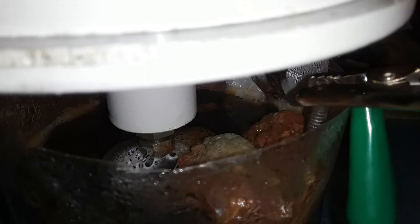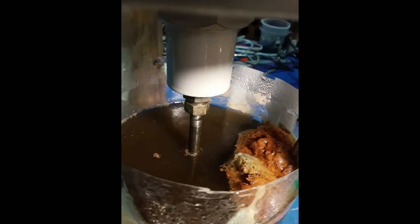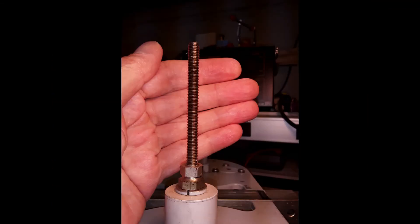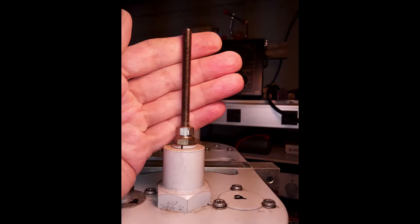I'm not quite sure what this bubbling is — is it breaking the water bonds giving off hydrogen and oxygen gas or is there something else going on? Just sort of looking at it, it's kind of like a disgusting lava lamp. I let the solution work longer this time and some odd colored foam appeared on the top. After I wiped the foam away I rubbed the screws with an old toothbrush and the rust had become a slime and it just comes right off. The nail in the process gets quite yucky and needed to be cleaned with a brush, but this method does a pretty good job of cleaning the bandpass screws — a whole lot easier than what I had done on the 440 duplexer.